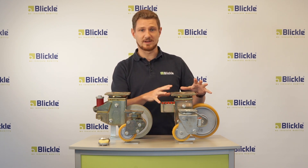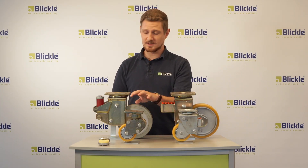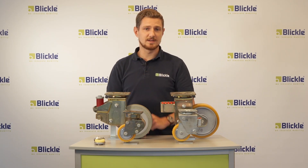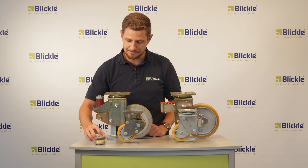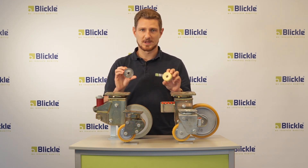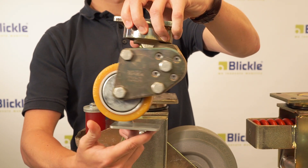The LSFN and the LHF series are based on a steel spring. The LPFE and the LSFE series have a polyurethane dampener. Unique to the LPFE series is the patented torsion spring construction, which ensures a small swivel diameter when swiveling.